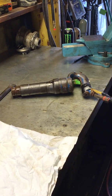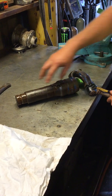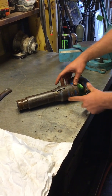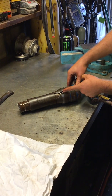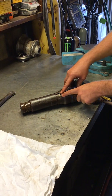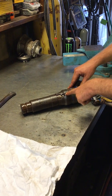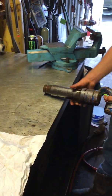Next, to pull the rest of the gun apart, you're going to separate the handle from the barrel. What keeps the barrel and the handle together are two items: a retaining sleeve and then a locking collar which is inside of that. We're going to spread the retaining sleeve and slide it down, then that will give us access to our locking collar so we can slide that down as well and then unthread the handle.